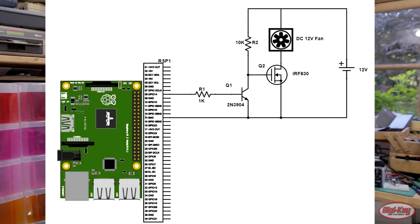If we look at the schematic, you'll also see that we have a single transistor controlling a MOSFET, which then controls the actual fan. Now the PWM signal from the Raspberry Pi is only between 0 and 3.3 volts, which is not useful for driving the MOSFET.